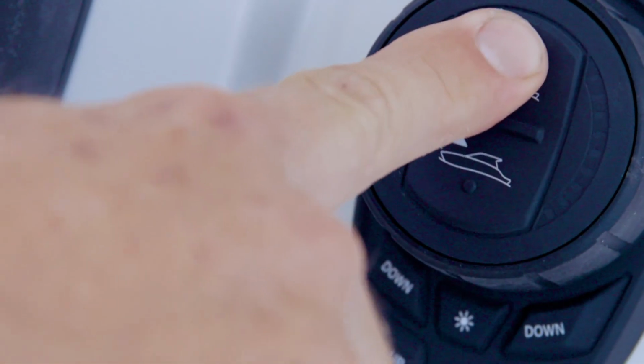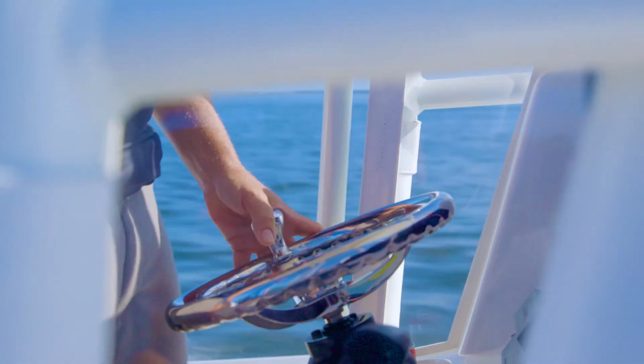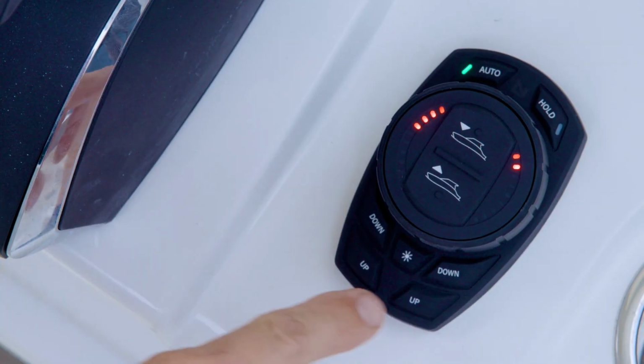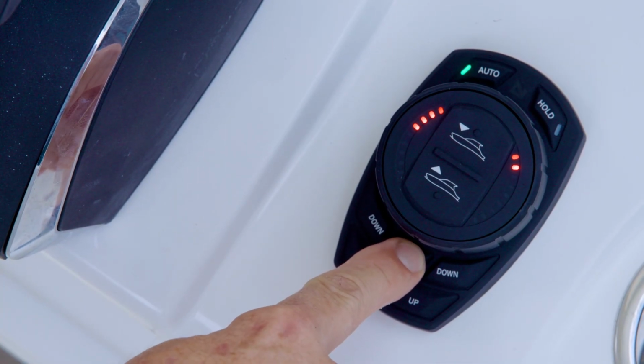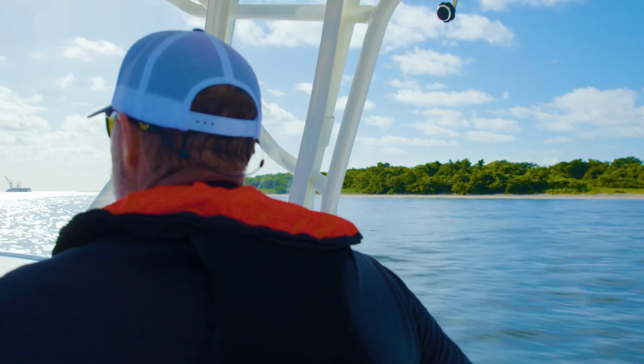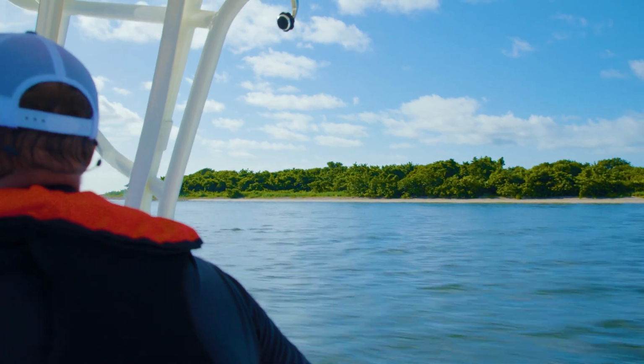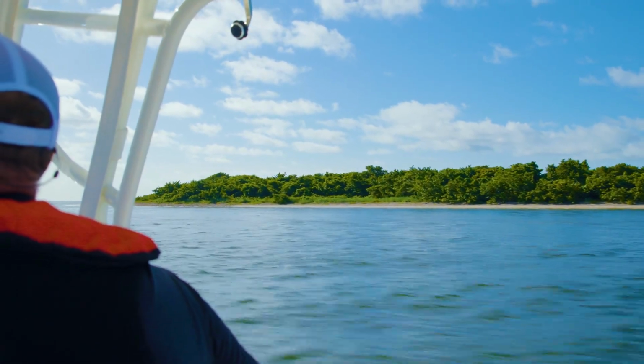Using the pitch up and down buttons in the center of the dial face, select the correct number of actuators installed in the system. Next, long press the dim button to auto-locate the actuators. Actuators are only to be connected over the Lenco 2K network, not the vessel's global NMEA 2000 network.